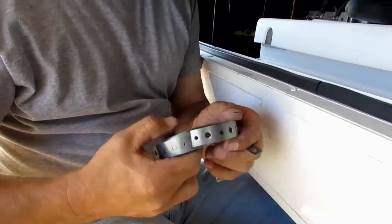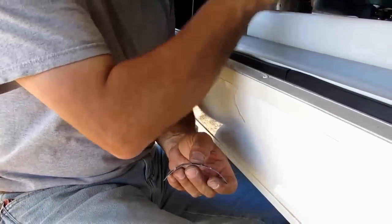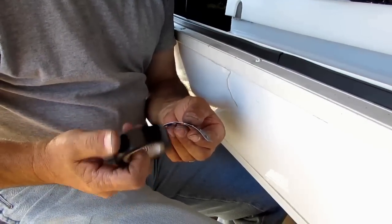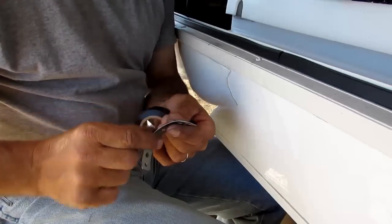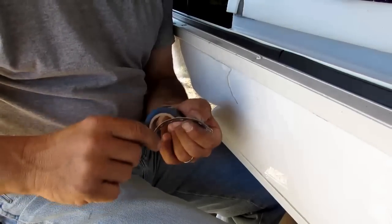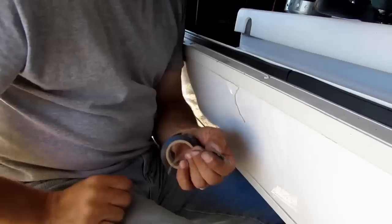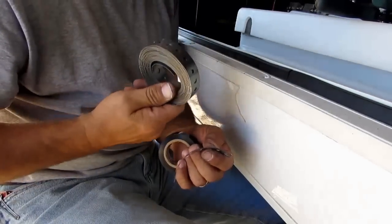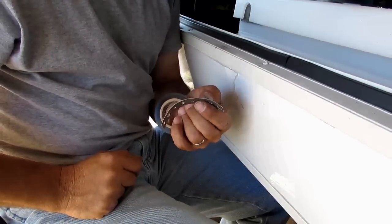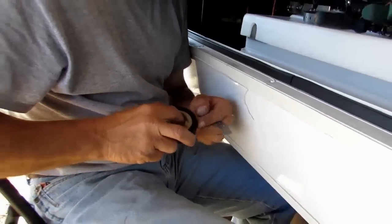This is a plumbing strap — I call it holy iron when I worked in the AC industry. All we do is cut it to fit. With this insulation, because everything's covered with real good insulation, we wrap it with electrical tape. You can also get some soft tubing and go across this to make a good clamp. If you figure out how much those clamps cost when you buy them per piece with the rubber piece on it — that's almost 100 to 150 clamps in that little roll. This is a couple of bucks, whereas those clamps if you bought them would be up to $15, $20, $30 depending on what kind you get. You can make them fit to each situation, cut them to your lengths.